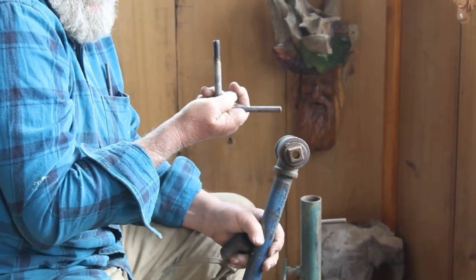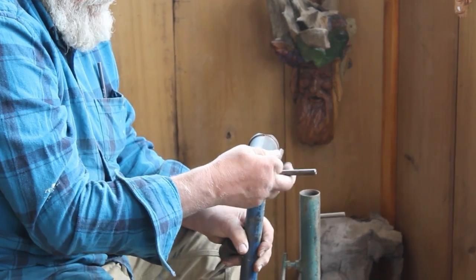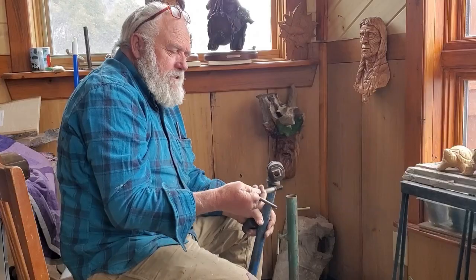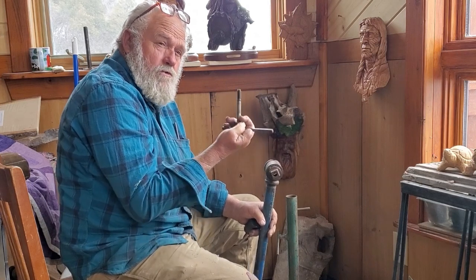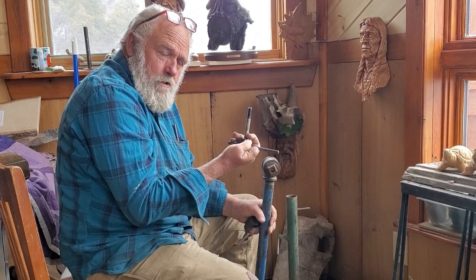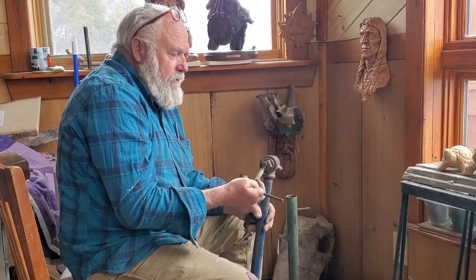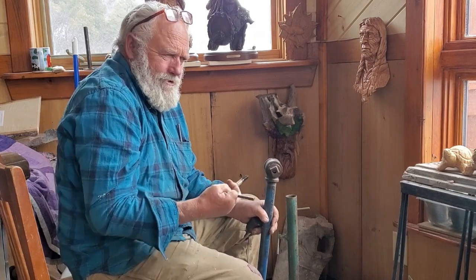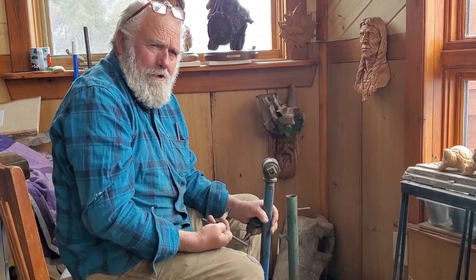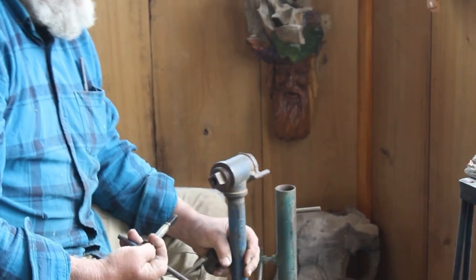I was using a half inch bolt that goes through that hole. Now, while I'm talking about this bolt — you have to use a hardened steel bolt. If you use a regular bolt, you'll pull the threads right off it. Early on I realized that ain't gonna work.